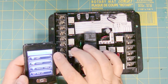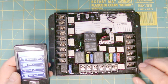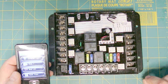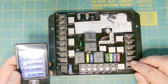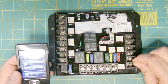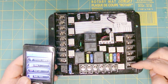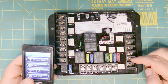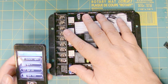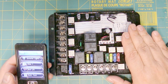In the remote there are several settings for things like a vent, exterior lighting and such. But the problem is these are all designed to work with a motor except for one channel. When I say they're designed to work for the motor, they're reversing. For example, channel 5 may be here and when you push the button one way, this is positive and this is negative, and you push the button the other way, this is positive and this is negative. So it reverses the motor. Plus, these are high current outputs, so really this is more designed for motor control. And there is no latching capability that I've been able to determine for any of these channels.